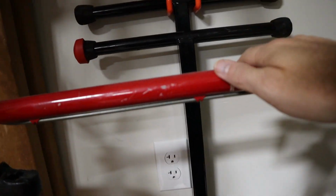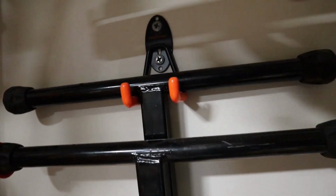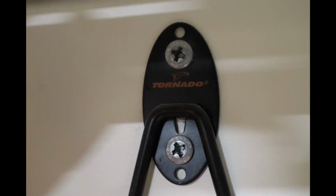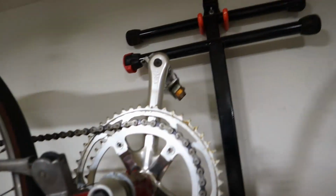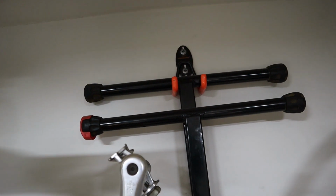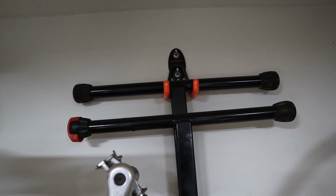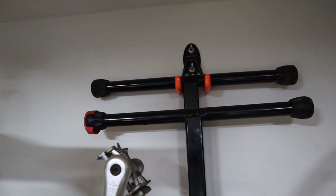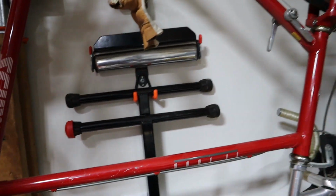Then the other thing I did was I found studs to put these. They're called tornado hooks. I had some already. I got the rest of them at Home Depot. I don't even think they carry them anymore, but I do believe you can get them off of Amazon, and they're really nice because they got big heavy screws. So if all you can do is screw it into sheetrock, they'll hold, I think, 25, 30 pounds. And then in this case, it goes through sheetrock and into stud framing, it holds up to 40, 45 pounds, I think. And so I've got those on there.